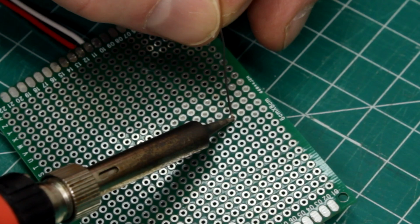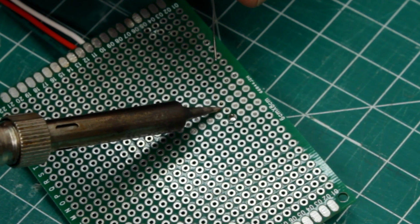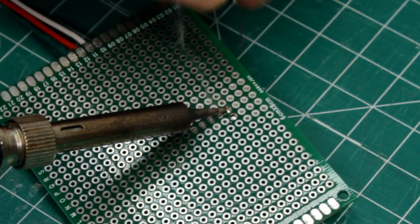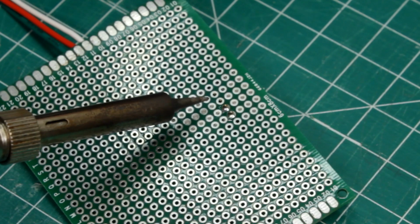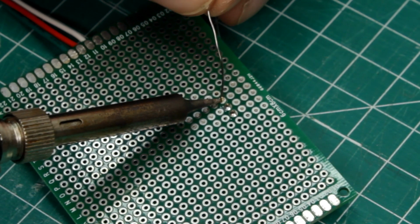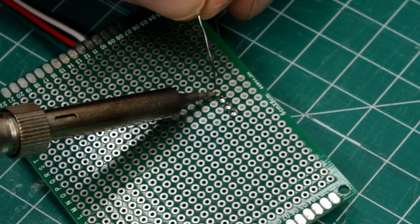When soldering components to pads, you need to get both the pad and the post hot enough to melt the solder, because, as I've mentioned, you shouldn't melt the solder with the iron. When the joint is hot enough, the solder will wick right onto the joint and make a nice little cone holding the post very solidly.